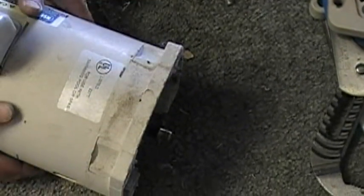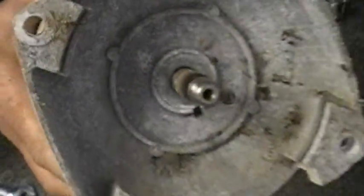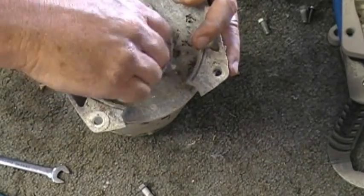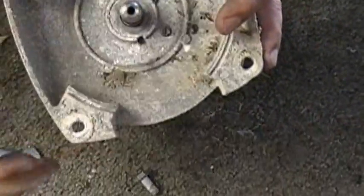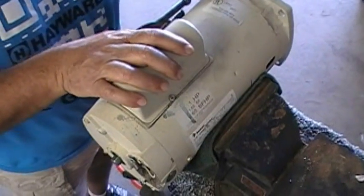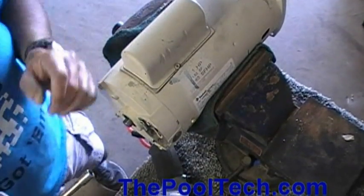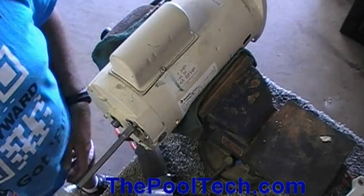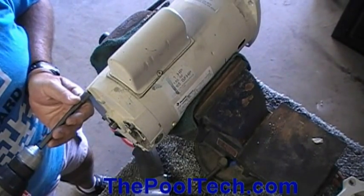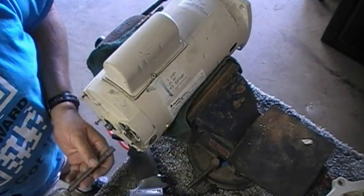The biggest thing is the motor. If you look at the front of the motor and what kind of damage we have — it's seen some water, and I'm taking it that it's this front bearing that's locked up causing this. It goes one way — it'll spin backwards but it won't spin forward. So we've got the motor up on a vise, a nice place just to support it. 5/16ths bolts on these — most everything we've seen is 5/16ths, 11/32nds, or quarter-inch. I've got a drill here, let's get these four bolts out and separate the end bells from the main motor casing.